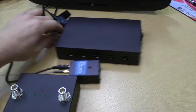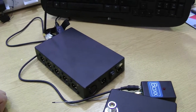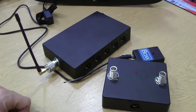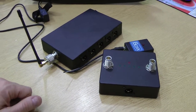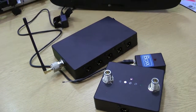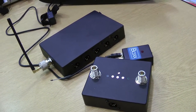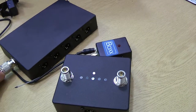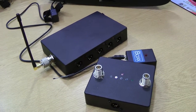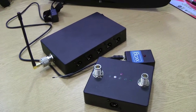So that's the tally light system — it's shipping now with about a three week delivery time. This should allow all the tally issues that aren't able to be done through the full telemetry system without using a CCU, as the full telemetry system requires you to modify the RCP to use tally through it — so this gets around that problem. It obviously also can be used with any system — wired or wireless cameras, or any brand of wireless cameras.